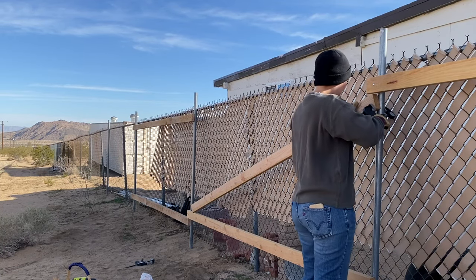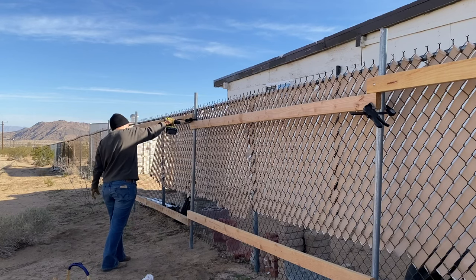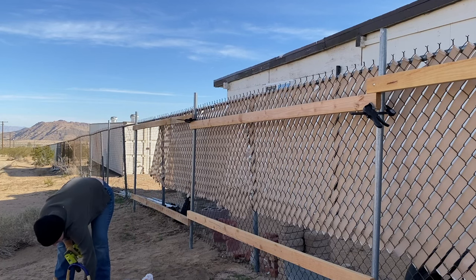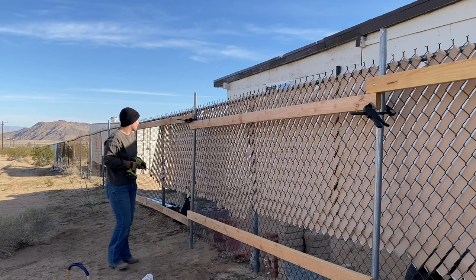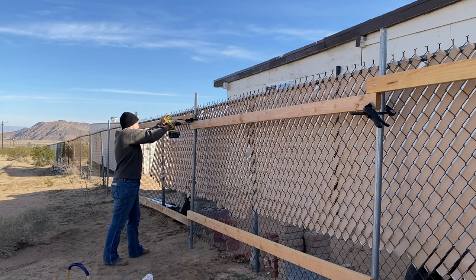That I ended up deciding was the best and the most efficient was to start with an extra long 1/8 inch drill bit, go all the way through the wood and the metal all at once, switch to a 1/4 inch extra long drill bit. Gosh, it's nice. Oh my gosh. Oh, I could sunbathe. Again, that would fit all the way through all the pieces, all the layers all at once.